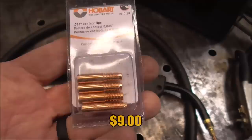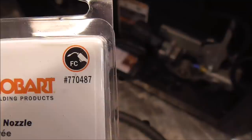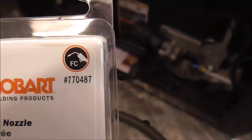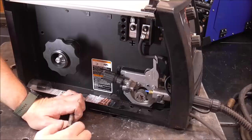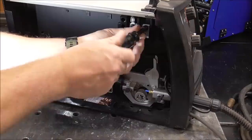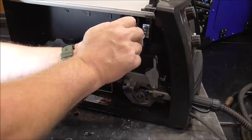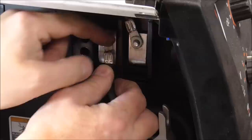If you're doing this conversion on a Hobart, here's the part number for the 35-thousandths contact tips — I keep them right inside the machine along with a nut driver to switch polarities. Solid wire with gas requires DC electrode positive. If you're running flux core or self-shielded, it uses DC electrode negative. So we've got to switch these connections around. Right now it's wired for DC electrode negative — we'll swap those over. We are now DC electrode positive.